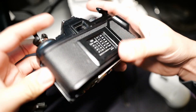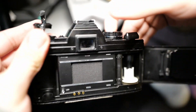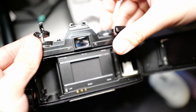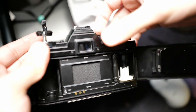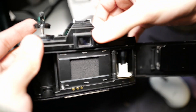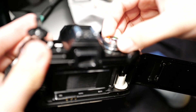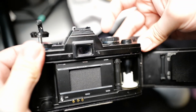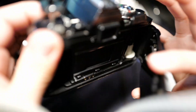Make sure it's just hand tight — don't overtighten, you don't want to risk stripping that screw. Now let's load this up, open the back, and it should fix the issue. Go to one second — works. One fourth of a second — works. One fifteenth — see how it works completely, the issue is gone. Let's try faster speeds: one two-hundred-fiftieth — goes all the way. Maybe one thousandth of a second — you can't really see it but it works.